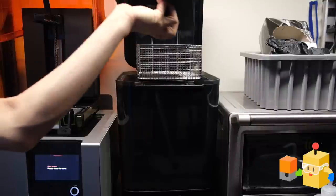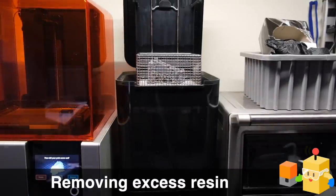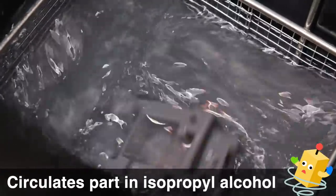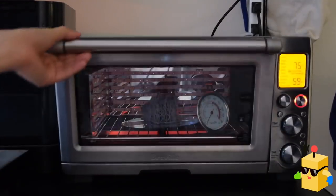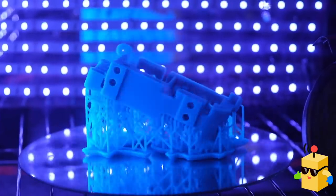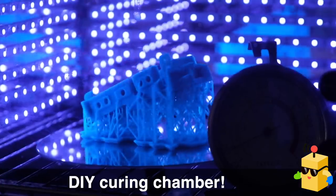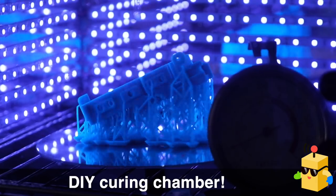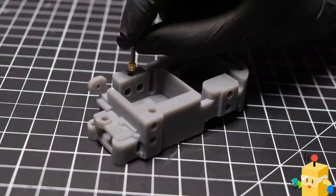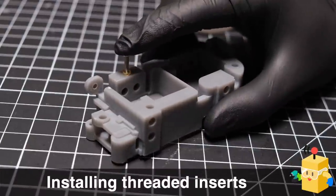The part is still covered in quite a bit of excess resin, so to remove that I'm going to put the part inside of this automated isopropyl alcohol bath. Now that we've removed all the excess resin, the next step is to bake the part with a combination of heat and UV light to increase its strength and durability. The curing chamber sold by the 3D printer company is quite expensive, so I hacked this one together using a toaster oven I got off Craigslist, some mirrors, UV LEDs, and a turntable I hacked together myself. I'm then going in with flush cutters to remove all the supports, and adding threaded brass inserts for strong attachment points.